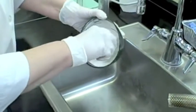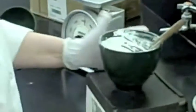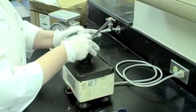If the mix looks a little on the thin side, add a few more droplets of powder to slightly thicken it. If it's too runny, it will be too messy to pour and your mix will also be weak. Now take your bowl of plaster, set it on the vibrator — make sure it's plugged in — and vibrate it for a few seconds to get the air bubbles to come up to the surface so that you get a denser mix.